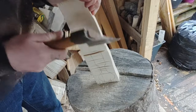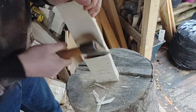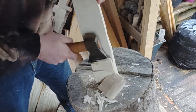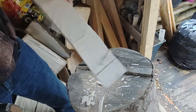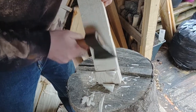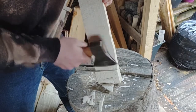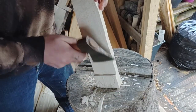You can use the axe to lever out any material that hasn't quite come off. See how the cut as I'm striking down is not going any further than that stop cut — that's why we put the saw cut in there, so you can start to create the crank. Just little taps. Choke up on the axe — put your hand further up the handle. Just little gentle nibbles — think of like a hamster nibbling on a carrot rather than a lion chomping down on a gazelle. Probably a bad analogy but you get what I mean — it's a spoon, not the animal kingdom.